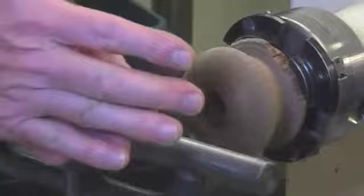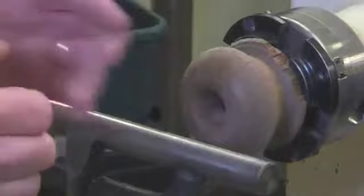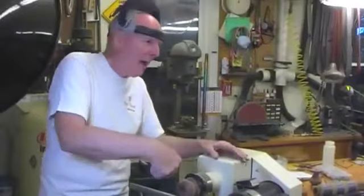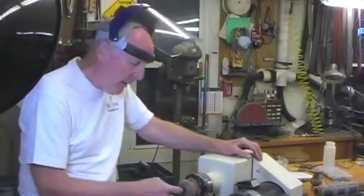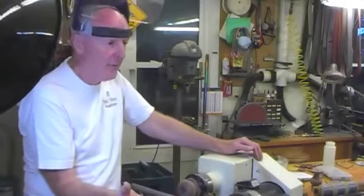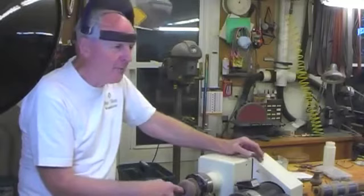Say you had something bigger here, and you're hollowing in, and you go in part way and create a cavity for the shavings. Say you're about 2 inches deep, with about a half inch wall thickness. You can determine your wall thickness however you want. You've got laser pointers, and you can stop and use dial calipers. Then go in about an inch to your final wall thickness, let's say a 1/4 inch, right? And then go in and true it up and clean it up as much as you want.